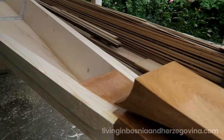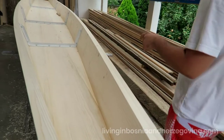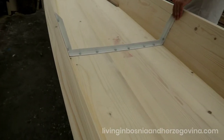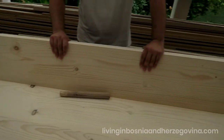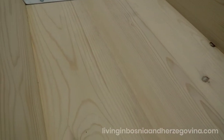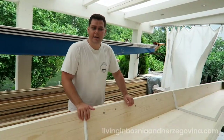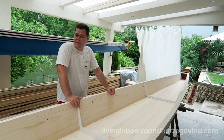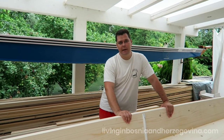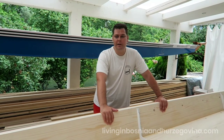That's not considering one year of drying. And of course you repair the boats as well. Inside there are three steel ribs that are used for structural integrity. This one is almost finished with assembly - there are a couple of things that need to be sanded down, a couple of holes that need to be plugged. Then it goes off to painting with different kinds of paints so the water doesn't damage it. The best practice is that each year before you put it on water is to sand it down lightly and apply another coat of paint, and fill up any holes with a filler.